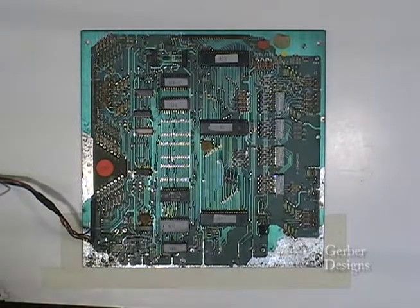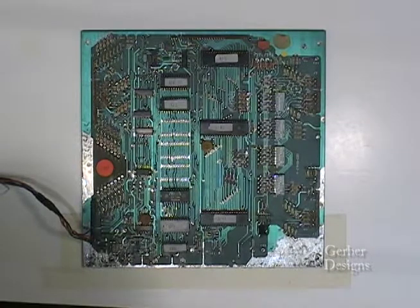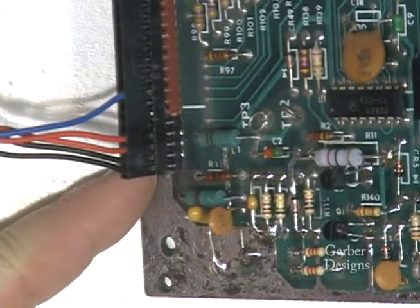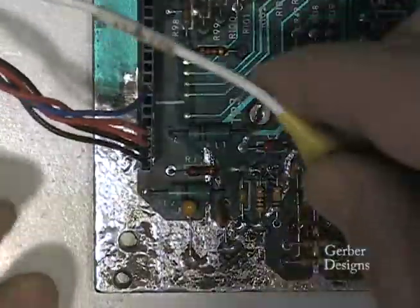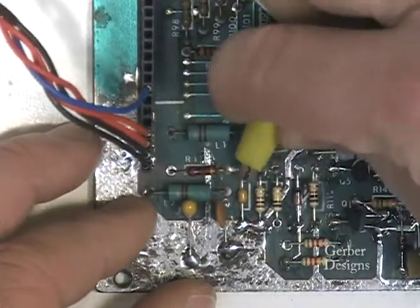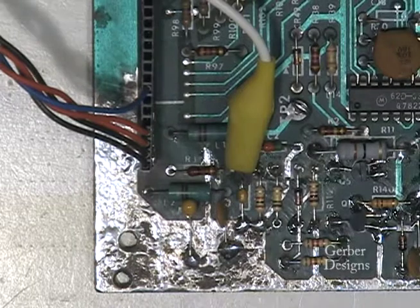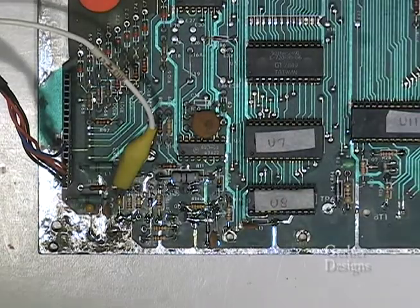We only have six flashes because our power supply isn't supplying 43 volts DC to J4. In order to get around this with a benchtop power supply, I have modified my power supply and will add a connection to the upper side of C1, which will allow me to verify the seventh flash. If you are using power from your pinball machine, you will not have to bother with this. The connection is made.